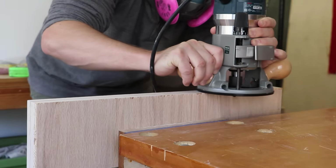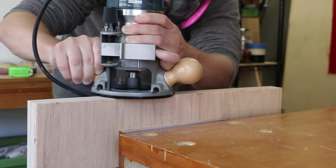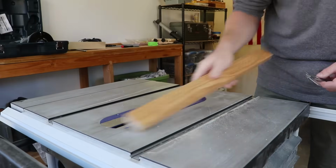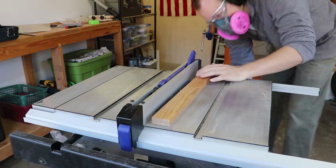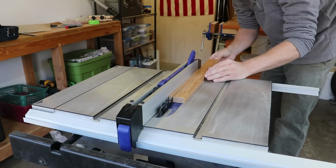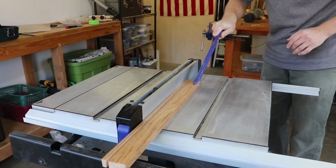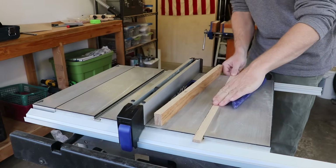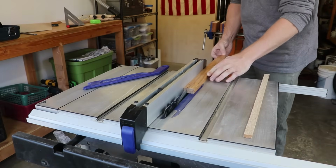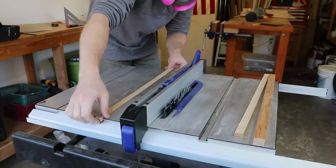The gutter is important because without it, your workpiece might have to sit against dust before it sits against the fence. The runners need to be made from dimensioned hardwood that snugly fits into the miter slot. The fit should be snug, yet able to slide freely. Cut runners so that when they lie in the miter slot, they lie just a hair under the tabletop surface. I was lucky that the width of my runners was the exact width of my miter slot.